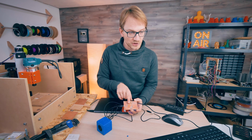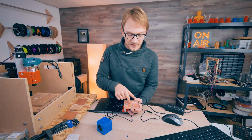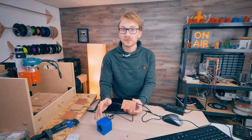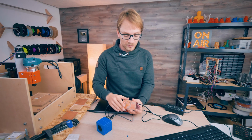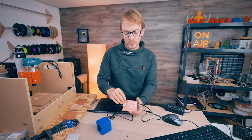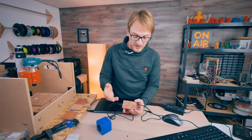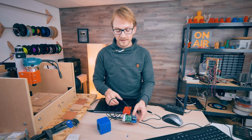Also, there is a second jumper wire here that connects these two ground planes. They are electrically connected, but it would have to go all the way around here and through here, so I just wanted a more direct connection. This is just one of the things with a single-sided PCB. You want a ground plane on pretty much any design. In this case, it protects against humming and other sort of noise that would get coupled into the board. But because we have a single trace running through this ground plane, this gets split up. In a two-sided PCB, you would have ground planes on either side, and that wouldn't be an issue. So I just connected these up right there. But electrically, this thing is working perfectly. There are no solder bridges, there are no shorts, there are no copper bits that stick out and short stuff out. This thing is working perfectly, and that, I think, is the entire point.